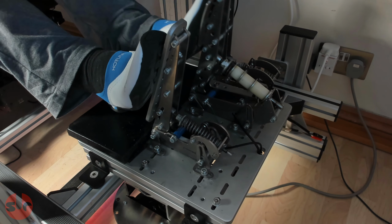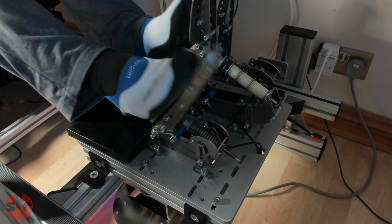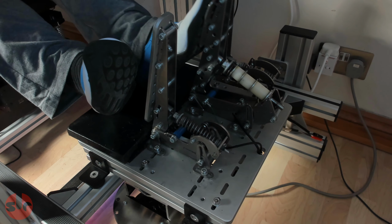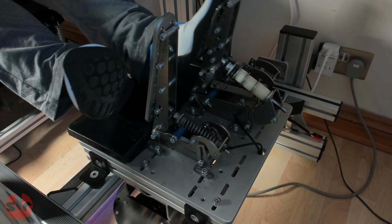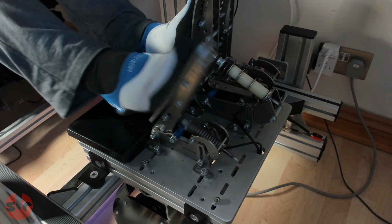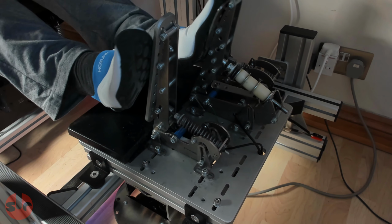I think a similar solution wouldn't be hard to incorporate into an aluminium profile seat frame either. So if you have an 80/20 sim rig with bass shakers or planning to add them, it's something that's worth considering. Separating the parts you want the tactile to excite with rubber isolators from the rest of the sim rig makes a big difference. It's not expensive, just requires some planning.